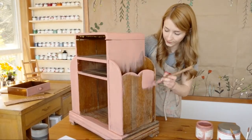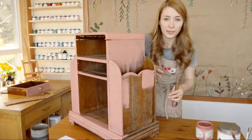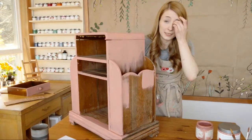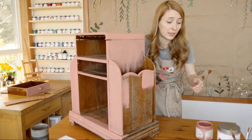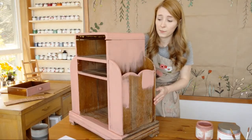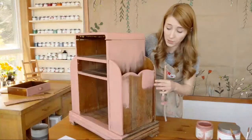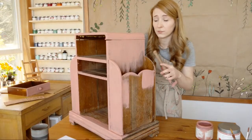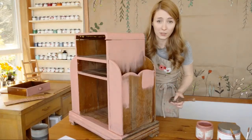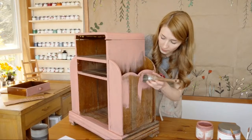Absolutely love them. Kimberly Drake just wants to know, are there any problems with bleed through since sanded? We were worried about that. When I was sanding it, I was worried that tannins in the wood would leach through, but I'm not actually seeing that on this piece. From what I've read and who I've talked to, it's almost a gamble whether or not you're going to encounter bleed through. I do have some Zinsser Kill BIN primer that would take care of that if I was worried. It comes in white, and I want to distress this later, so I'm just going to take the risk, and I'm glad I did because I'm not getting any bleed through so far. But that could happen when it's fully dry. You never really know. I am going for a rustic look though, so I kind of just like to paint on. Good question though. We've noticed that too with top coat. We don't see it till we do a layer of that. Sometimes a top coat can bring it up.